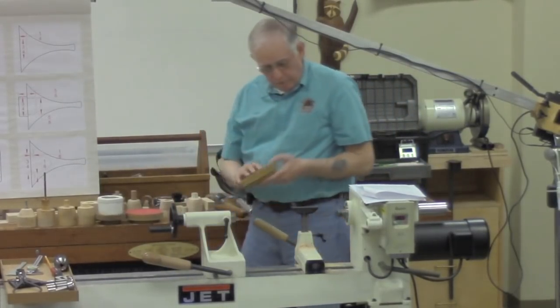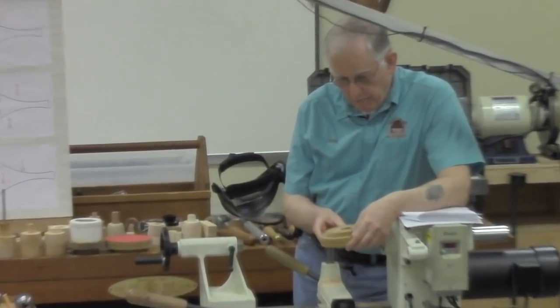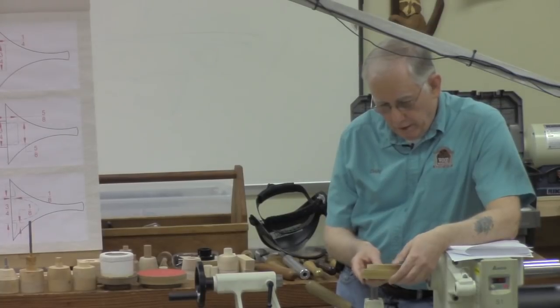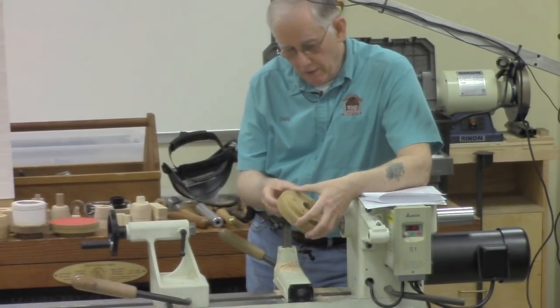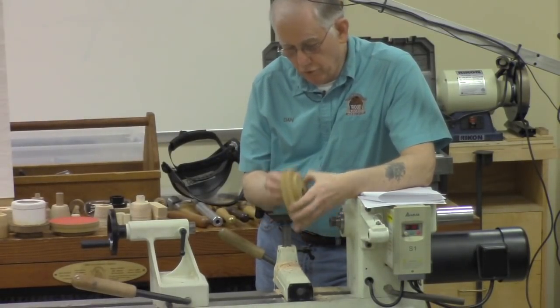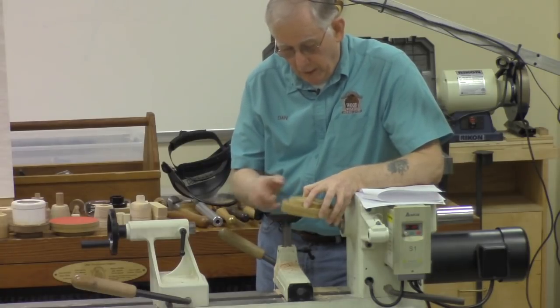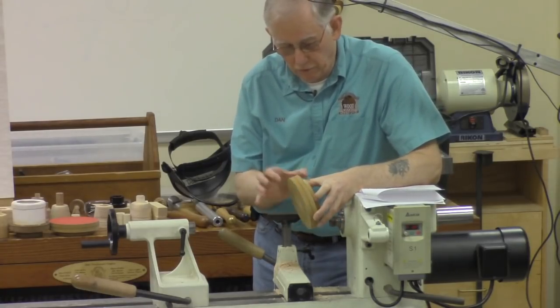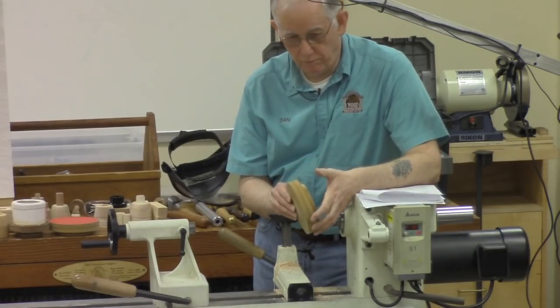And here's some that I did for my segmented projects. It's threaded. This is just MDF. I've heard people say you don't use MDF because it'll split. So what I've done is I've taken screws and run the screws all the way through. Here you can see this screw came out right there, and I followed it off. And this screw comes in a little bit shorter than that. So the screws going in from both directions hold that MDF to keep it from separating.